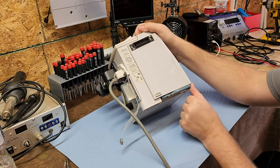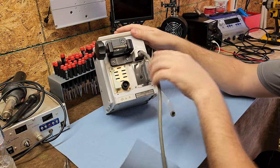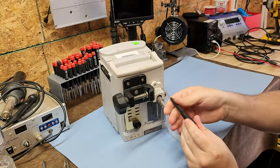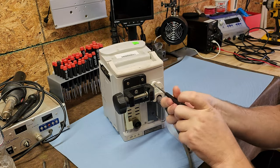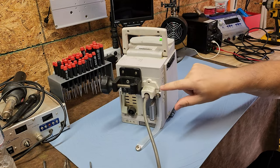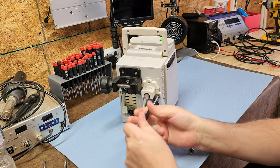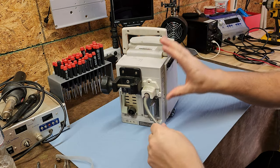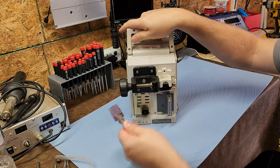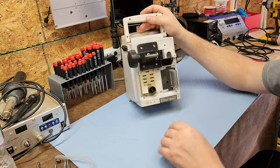Let's go ahead and take this apart. Notice you have a spring-release latch on one side because your modules latch on there. You have an IEC that is being clamped down, and it's a number one Phillips — of course it is. Some of the things I've noticed over the years are not just bad ports where they get corroded, but this fastener here is definitely loose. This is for the snap which is your cord retention, and this port can usually just rock out — it's kind of limited by the clamp. Horrible design, but this unit was designed about 20 years ago.